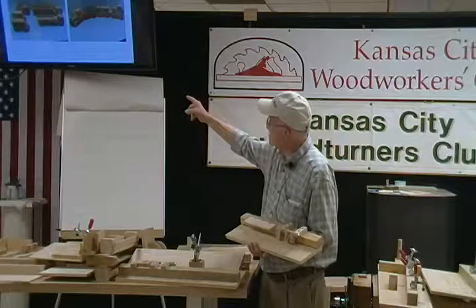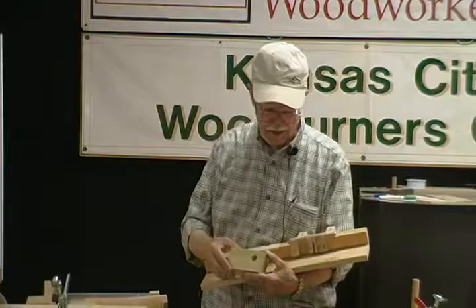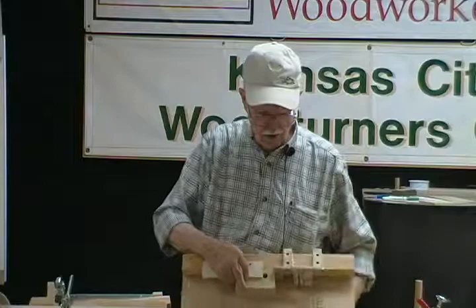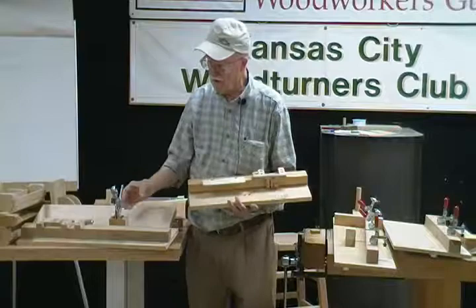On the picture of the little trucks and trains, notice that the window hole is always in the same place on them, whether it's a trailer truck, box truck, or whatever. This jig sets you in here and you can establish where you want the window. You can either drill it there, or if it's a different model of truck, you've got a good stop and you can drill down to there. This allows you to have a variable stop position on drilling the window holes.